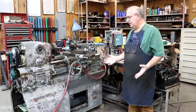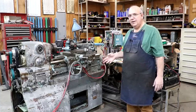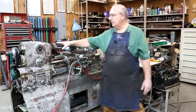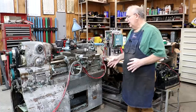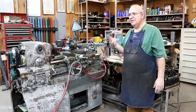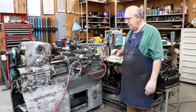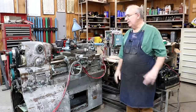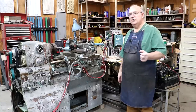Unlike most machines, the 10EE is a little bit different in the way it works. In most lathes, you have either a single phase or three phase motor running at a constant RPM, and you change gears on the machine or change the belt arrangement to change your speeds. With this 10EE, instead of having an alternating current motor, it has a direct current motor that has the ability to change the speed of the motor — basically motor speed is what does your speed control. You have an infinite number of speeds between the minimum and maximum that you can adjust by just turning a dial.